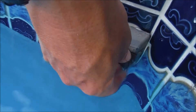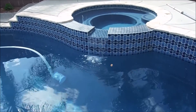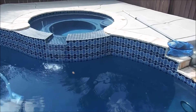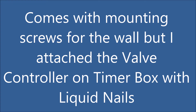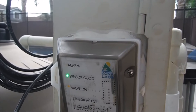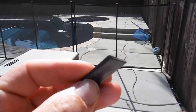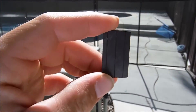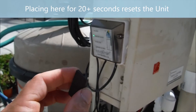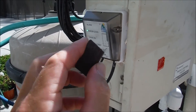That's where I want the water level — I'll take the magnet off. A quick installation note: you don't want to mount the sensor too close to a waterfall or spillway feature, as splashing will upset the sensor. This one is far enough away. Once you reset the level sensor with the magnet, there's no need to come and reset the control panel separately. The magnet that comes with the LevelSmart is used to reset the sensor, reset the control unit by placing it on the square, and also to test the valve to see if it's working.